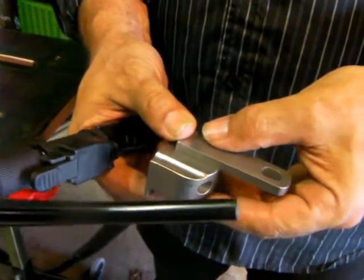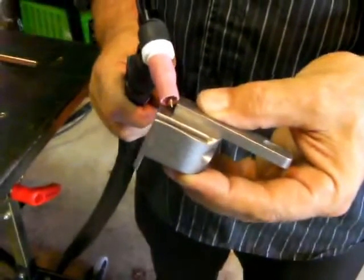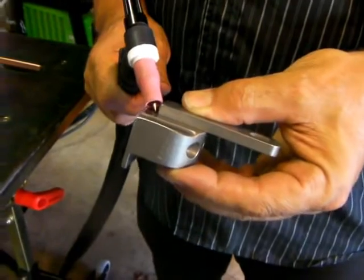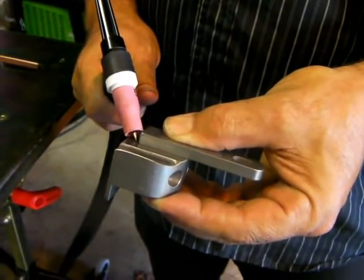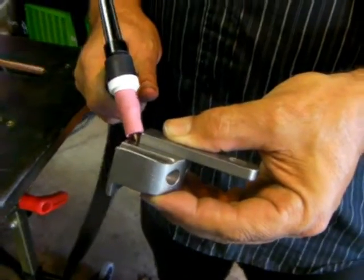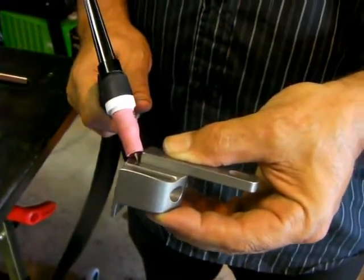The speed tacking thing basically just involves turning the machine up to an amperage like over twice as much as you would weld with, and then giving it a blast — just a very, very quick blast. That will melt the metal and drive it together and fuse it a lot better than sneaking up on it and gradually increasing the amperage with a foot pedal.